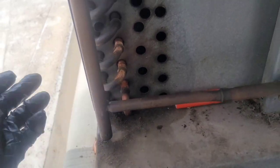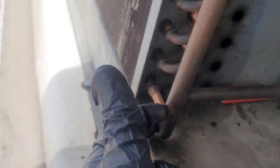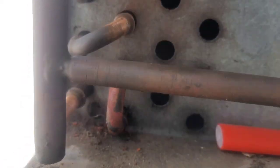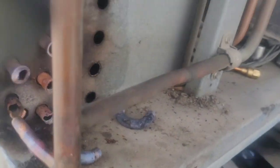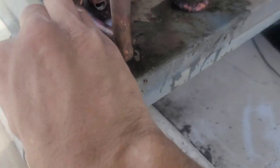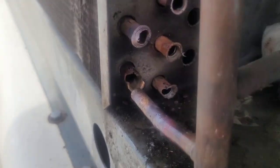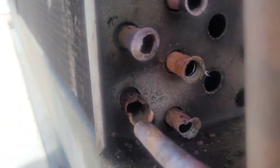I can't record this part but I'll tell you what I'm doing: I'm going to heat the bottom one up first, pull it out so I have room to work, then heat the next one up and pull that loop out, then the next. Use a wet rag to make things go faster. Got to watch out - don't let hot solder get on the roof and melt a hole in it. The store won't like that.